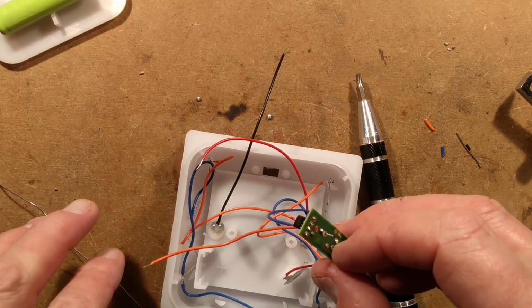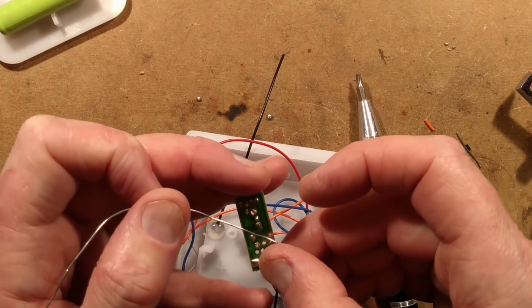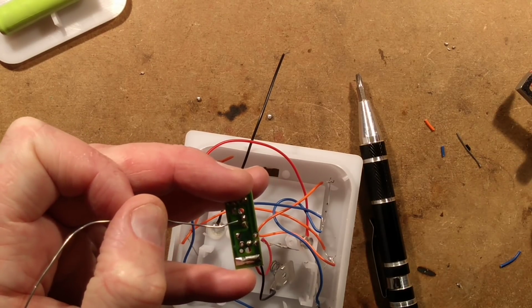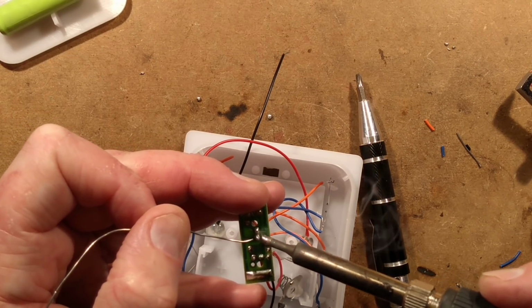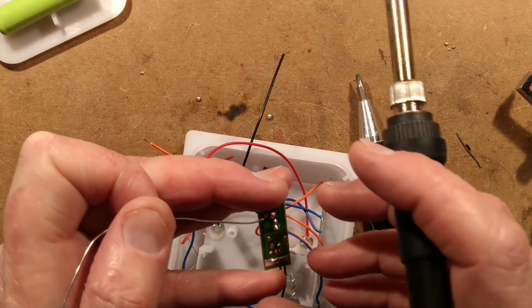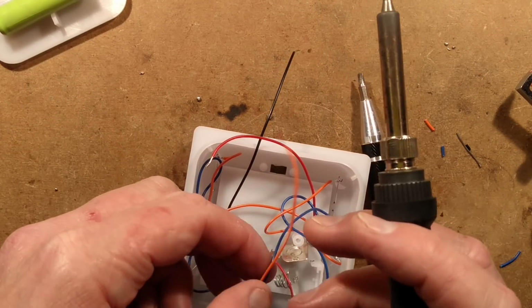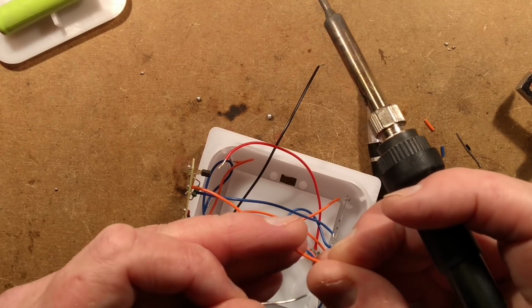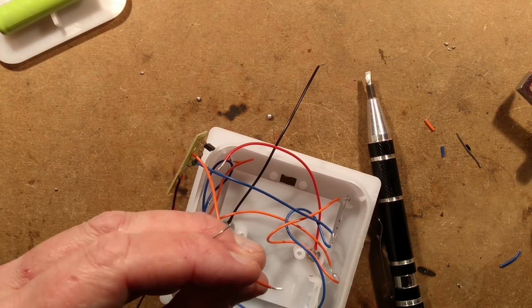That's one of the main differences between the solar lights in dark countries and bright countries. In a place like Australia, they might deliberately run the LEDs a bit higher current because they know there's going to be lots of sunshine during the day. But in a place like Scotland, if the solar light's been designed for the Scottish climate, you'll find that it tends to run the LED at quite a low current because we don't get much sunshine.